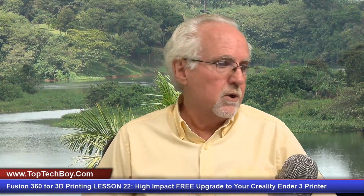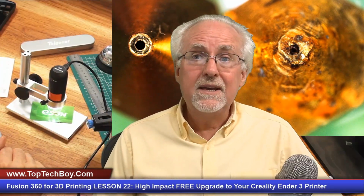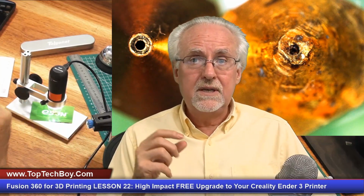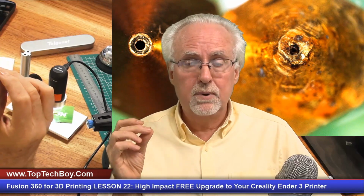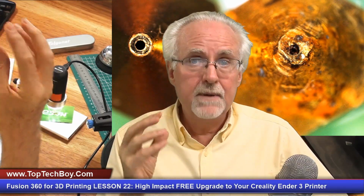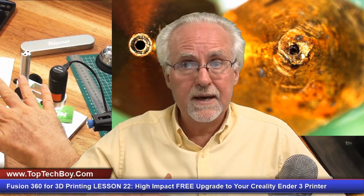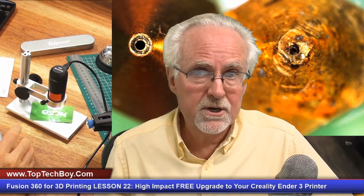If you remember last week, I showed you that my number one recommendation for upgrading your printer is to simply buy a spare pack of extruder nozzles. I showed you this example, and this again is a live picture. On your right, you can see an extruder nozzle that I'd used to make about 15 or 20 prints, and on the left, you can see a brand new extruder nozzle. You can see that this nozzle had become damaged on the tip. It is partially clogged, and it is no surprise when you look at this mess that I was not getting good prints. My prints were not adhering to the print bed, and I had all types of quality problems in the print. Why? Because I had a damaged and partially clogged print nozzle.